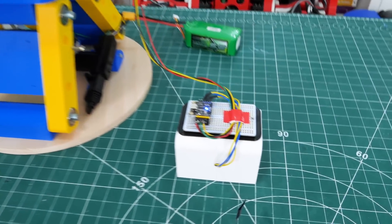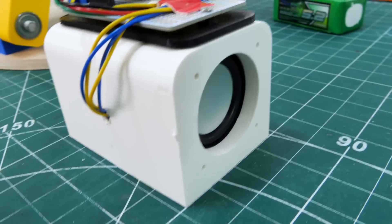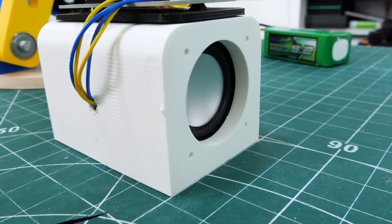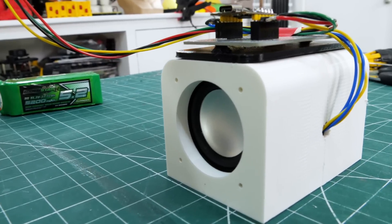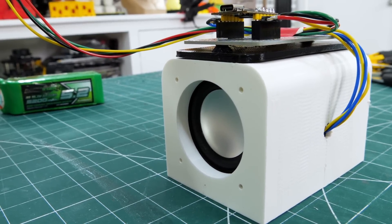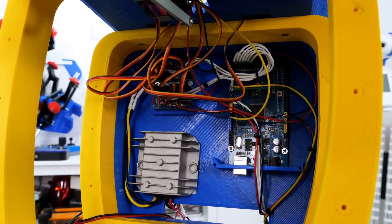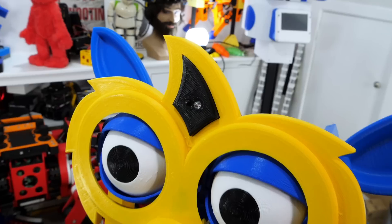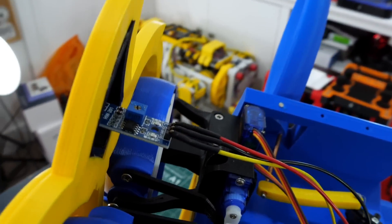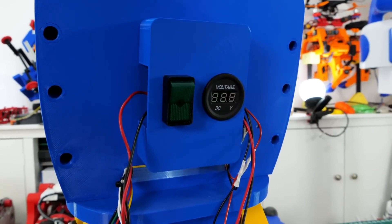Right, let's carry on with this giant Furby. It needs a sound system to play some sounds, so I've got a DF Robot MP3 playing board with an amp built in - you can play it straight into speakers and it's really loud. The electronics live on a panel in the back with the Arduino, cables going up to the servos, and the speaker and sound system live in the base. It's got an infrared proximity sensor - an off-the-shelf module that just gives a signal to the Arduino - and that's in the head, with power distribution around the back with a switch.